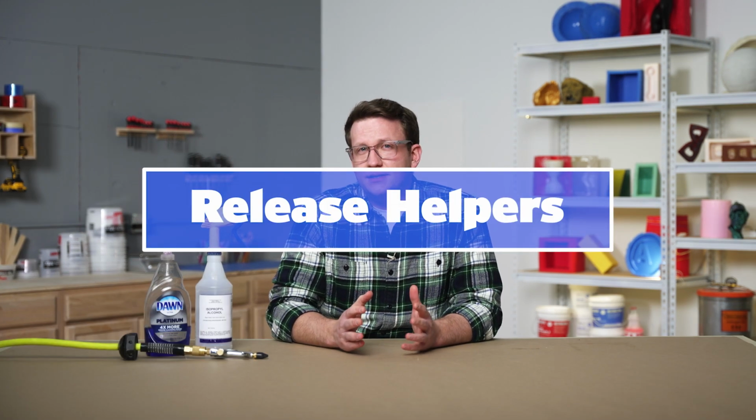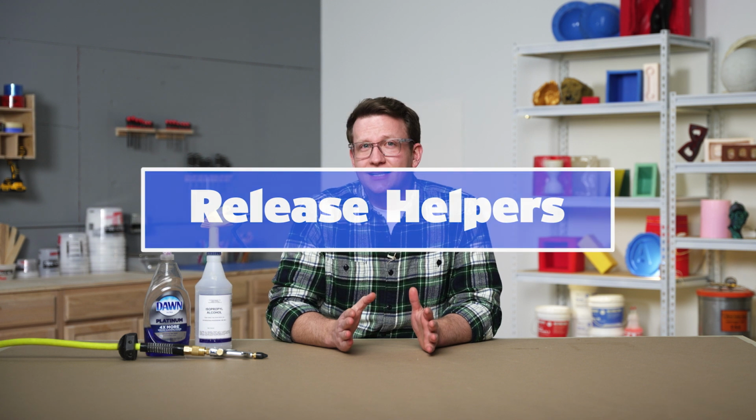Sometimes our demolding process can feel extra difficult. A lot of stretching and pulling isn't quite releasing the master from the silicone, or we just can't seem to get the bottom of the mold to release from the master. In these situations, we can use a few release helpers to help break the tension between our master and our mold as a last resort. Let's look at a few release helpers and see how they're used.